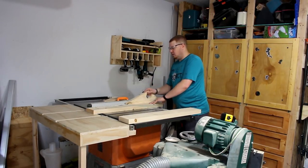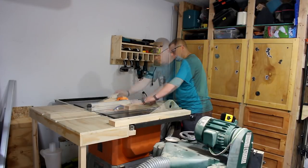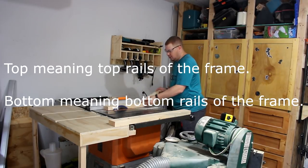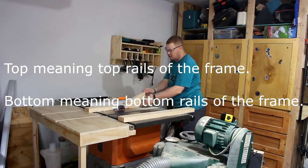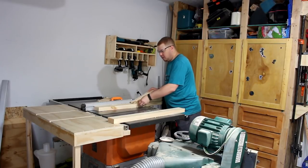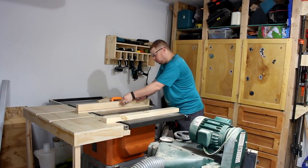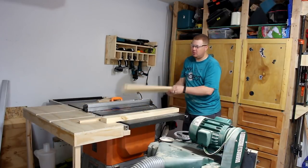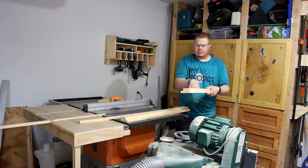For the top — how I'm going to attach the top and the shelf — I'm going to try to cut a dado on these boards here. I've already cut one edge to make it square, and I've cut about an eighth of an inch off. I'm going to cut the top piece of the table two inches wide, so I'm going to go ahead and cut that now at the table saw. That'll leave me a little over three inches left on the bottom piece, and I'm just going to work with whatever amount is left on that. These will be able to run along the bottom, and the shelf will just attach right to this, sitting right in this little groove here.